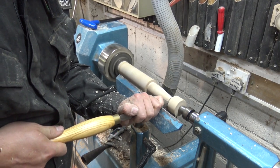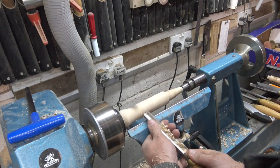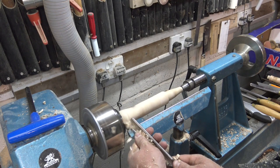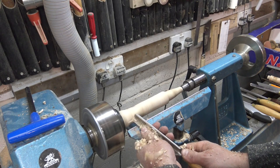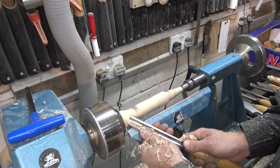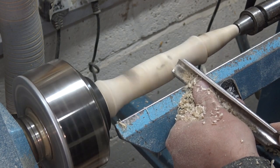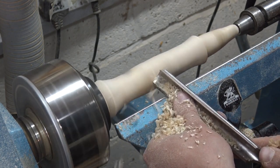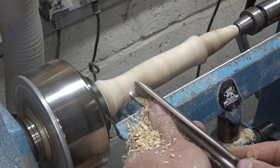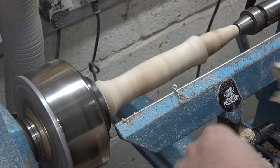This is where I'm going to be parting off — always the fun part. I'm parting all the way through and as I get to the point where I think I'm going through I put my hand behind to support the piece. This time I'm using a one-inch roughing gouge to put in the profile, and I wanted to show the wings of this tool and how I'm going to use them to cut the piece. This one took me half the time the other one did with the skew, mainly because I'm more used to using this as a production tool. I'm using the wing of the tool a bit like a skew — you can see it picking up the cut with the cut trailing in front of the gouge, giving lovely tiny shavings and a smooth finish straight off the tool. I'm cutting downhill to support the cut and there's a really cool knot in this piece too.